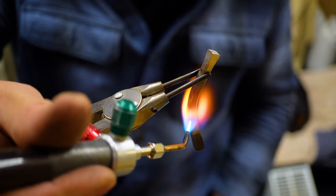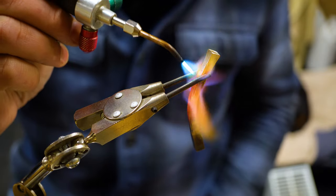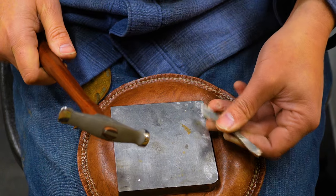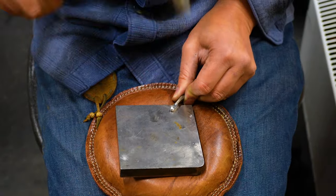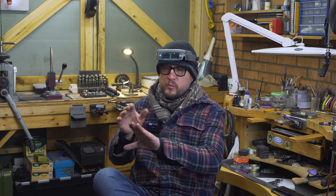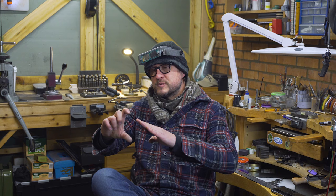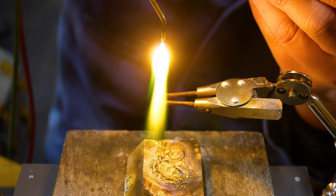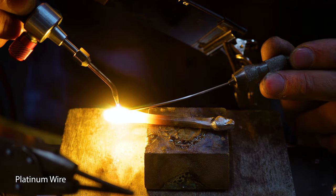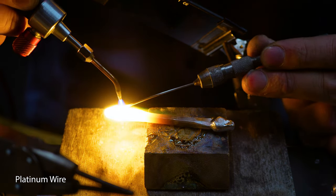As I'm going with this the whole time, I'm negotiating with the metal. It's doing what I want it to do, but slowly moving towards it. I'm now taking my goldsmith's hammer, shaping it, bending the point and flattening the top so I can see what I'm working with. Once I've flattened it to a point where the stone can be seated, I can measure the height — I'm looking for a 6–7 millimeter height, which is quite a lot, but I need to achieve that. So once I've hammered it and got my flat surface, I'm going to use wire to fuse on top of the platinum, thereby building it up to get my height as well as my width.